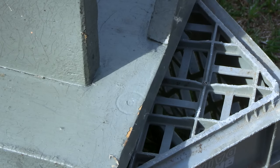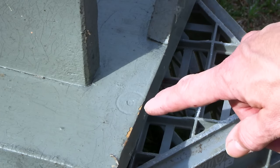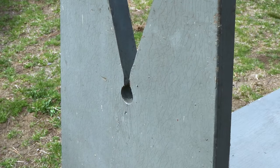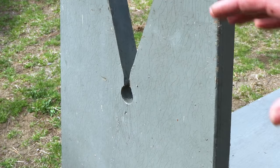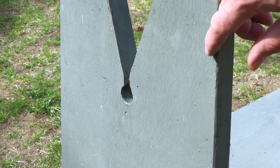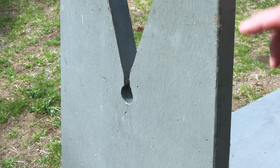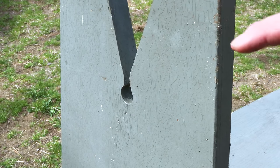On the underside of the seat, you can see this faint outline of an auger bit that just touched the surface before whoever was drilling stopped. The carpenter was drilling holes to add style to the boot jack ends, but one of them has a super ragged, chipped-out exit hole — this is probably pine, and you need to support it when drilling. He saw that first exit hole and thought 'that won't do.' So he laid the board down on the seat piece, using it as a backer while drilling through, and got a nice clean exit hole on the second one. I love seeing how he used the materials as a work surface and adapted as the build progressed.